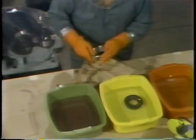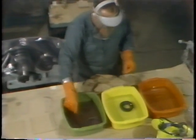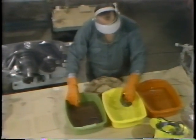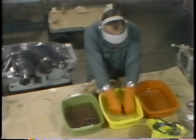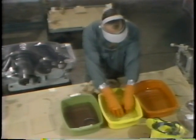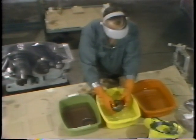When he's satisfied that there are no obvious defects in the outer ring, he places it in the lubricant bath. Then he turns his attention to the inner ring and the rollers. Again, he uses a swirling action to remove any leftover lubricant or grit from the bearing.